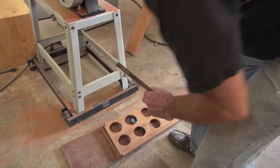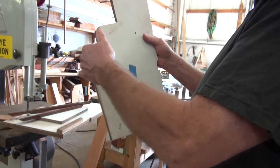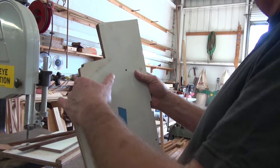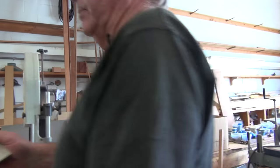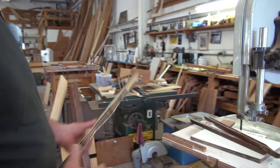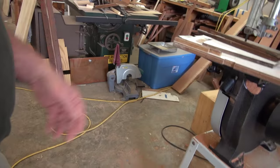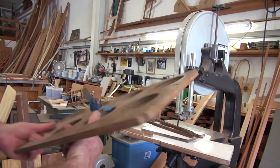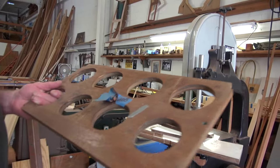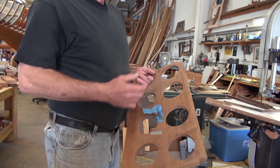They fitted their dividers — which are delaminating — to the hull and the sheer clamp shelf, so when this cabinet went in the whole area was sealed off with Masonite. Just terrible — that's where all the termite and mildew damage was happening, because it traps moisture and everything delaminated. So you can either save it or make a new one. If you try to save it you've got an hour just to get rid of the mold, wipe it clean, and start sealing it.